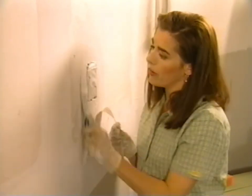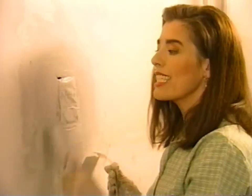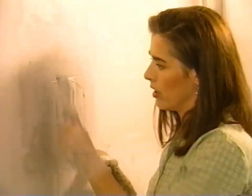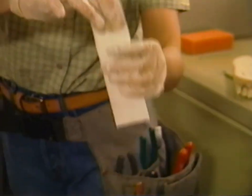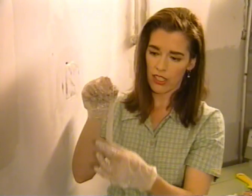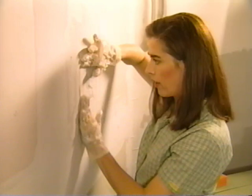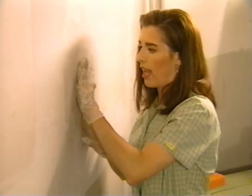I'm going to put the tape back on again, but first just to make sure the tape is happy, we'll put a bit of compound around the hole. It looks like it's bulging, but I wager the tape will hold it just fine. The cool thing about drywall tape is that it has a little crease preformed down the middle — put it on the wall with the indent out so that when you're sanding later you won't have a little ridge that you'll end up tearing up.